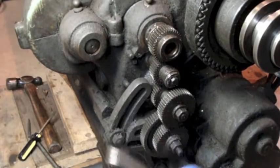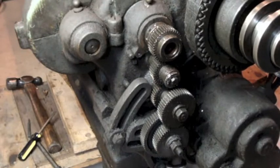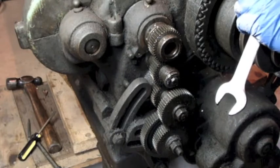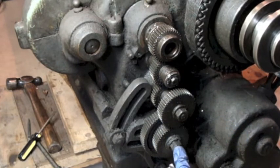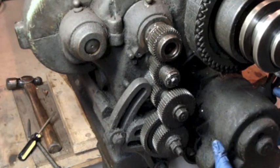If I loosen this bolt, that'll allow this to slide down when I loosen this nut and this nut. This bracket I just looked underneath — it's actually a much larger bracket in a slotted hole too. The pivot point for this whole bracket is up underneath here, behind this whole box assembly. This box assembly almost looks like it comes off fairly easily. The quick change gearbox is behind here — I think I read somewhere that's actually called a Norton style, or is it Pratt Whitney? Anyways, I'm thinking I could take this whole assembly right off.